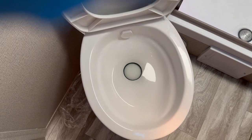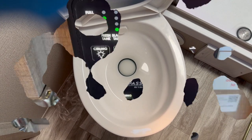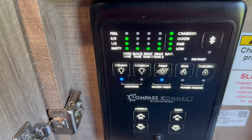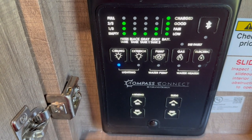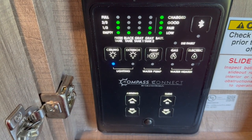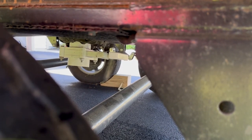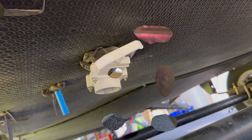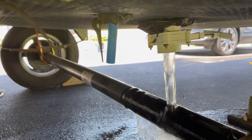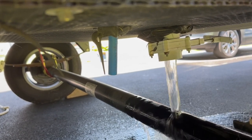All we have to do now is remember to go out there and change the valves on that hot tank. Let's get that done. We're on the home stretch — let's go ahead and turn off that pump, and now let's go drain our water tank. Then we can change our hot water tank valves and put them in summer mode. Let's dump out any excess water we have in our tank. Once that's empty, we can switch our valves to summer mode on the hot tank. As soon as we're done draining the water system, make sure that we shut that valve.